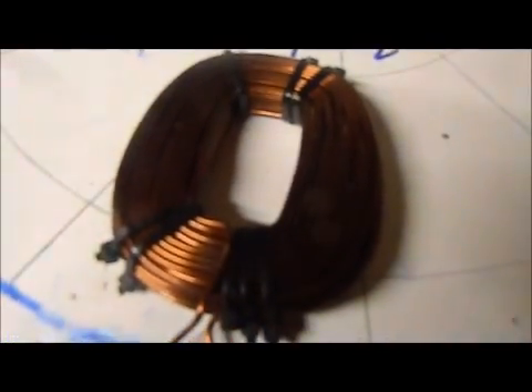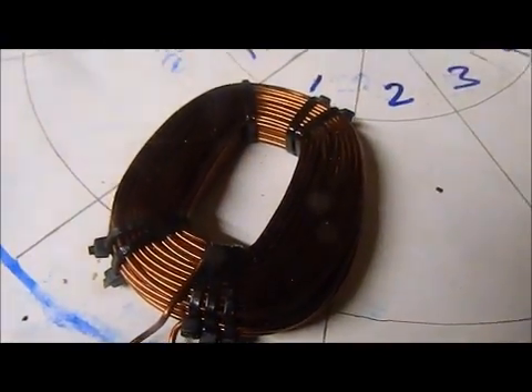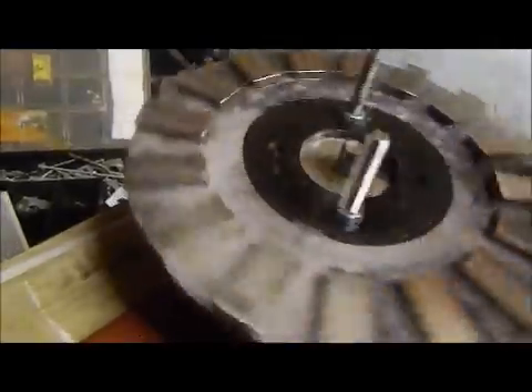They're 24 volt, theoretically — 80 turns of 14 AWG, and there's 12 of them. I haven't got a multimeter, but I have managed to test the coils by giving them a good spin on here and shorting them. All of them produce a judder which is quite noticeable, so you know, that's good enough for me. Got a new multimeter on order.